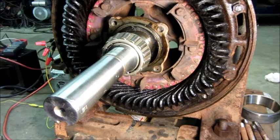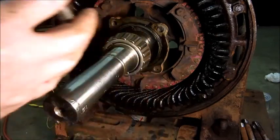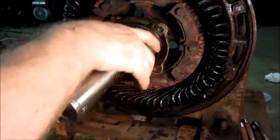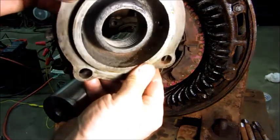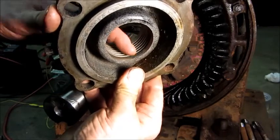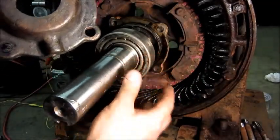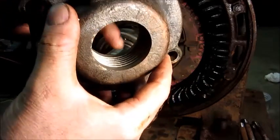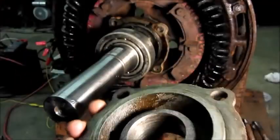I took the front bearing apart to repack it and found it in pretty good condition. There's one spot with corrosion, but since this is going to be more of a running display than something that runs every day, I'm okay with that — you guys heard how it sounded, even with old grease, it didn't sound that bad. Interestingly, this collar has grooves they call a labyrinth. When it fits over the shaft, it helps keep grease in and water and dirt out — not a true seal, but such a complex pathway that it keeps everything protected.